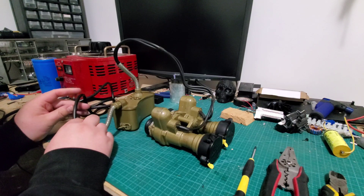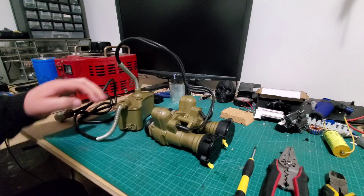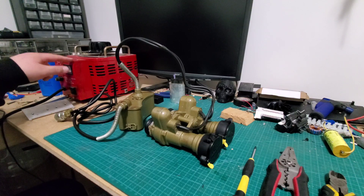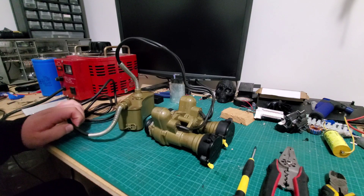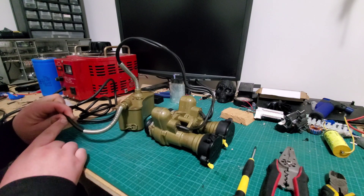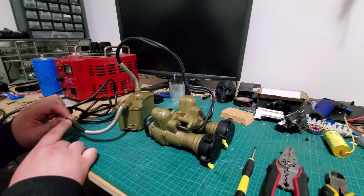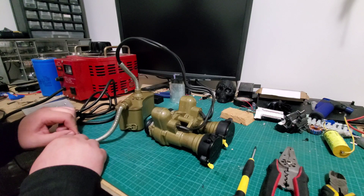So the best way to do that is to cut this cable, open it up, and then hook up your power source to the circuit board and take a voltmeter to figure out which wires are positive and which are negative. My buddy is going to help me with that because he did it last time pretty fast, so we're going to use that method.